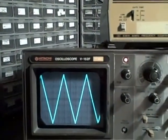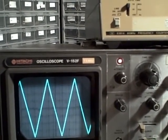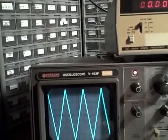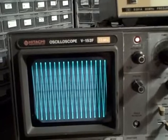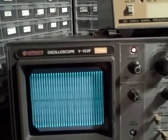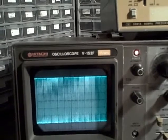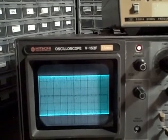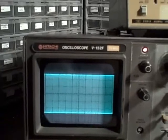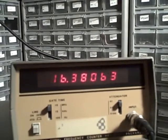Once again, we're going to start raising the frequency. We'll see that the signal stays flat — 4 up and 4 down — until we hit the frequencies at which we start to fall off. We see now that we are beginning to fall: here's 3.2, there's 3.0, and 2.8 right about there. The question is, what frequency is that at? Let's look at the counter — we're about 16 megahertz, 16.3 in this case.